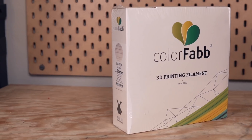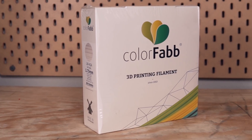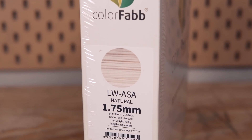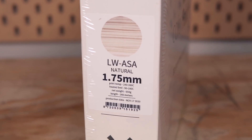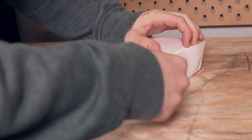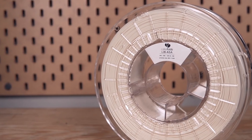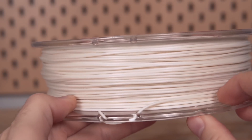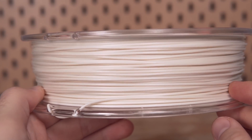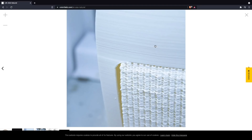That's much better than the $40-plus price point I saw when making that video last year. Today we're going to be looking at a very unique filament called Lightweight ASA. Just like regular ASA it has fantastic UV and temperature resistant properties, but the very unique property is that at certain temperatures the material will actually foam or expand up to two and a half times in volume, giving you incredibly light pieces.